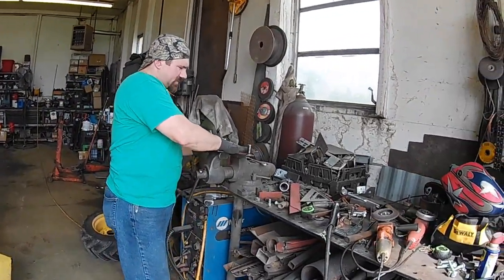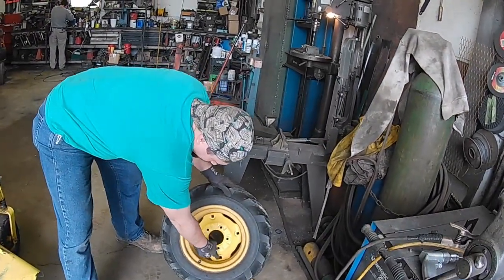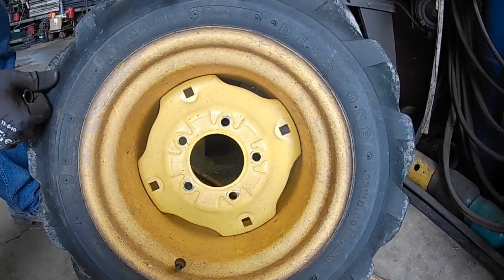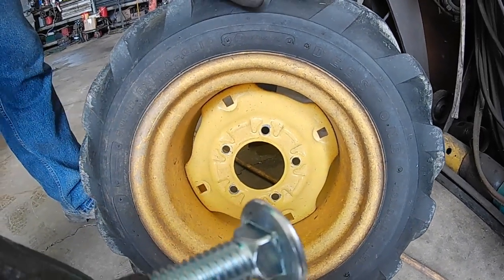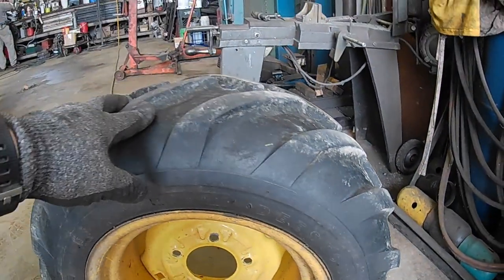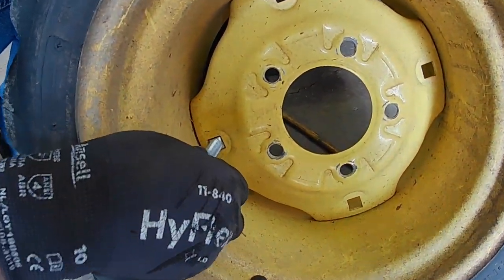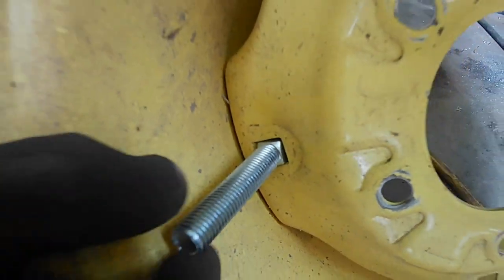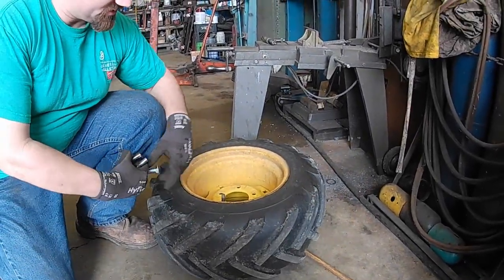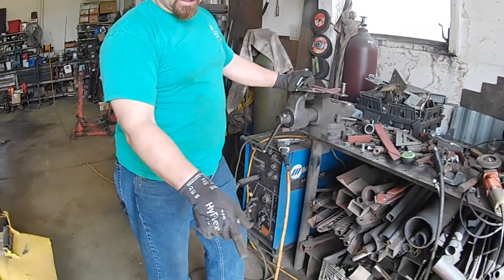What I'm doing here is I've created these pieces of metal to act as a brace to go across the wheel. Inside the wheel I've got squares — I've got carriage bolts that will fit in there so I only have to put the nut on from one side, and the square on the bolt will actually hold itself still inside the rim. The carriage bolt goes through and the square sits in there so it can't turn. Then that X is going to sit on the rim and I'm going to drill two holes and weld two bolts through and into one of those rotors, then weld the two rotors together.